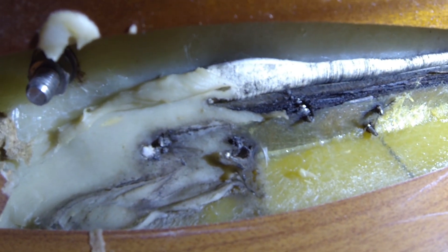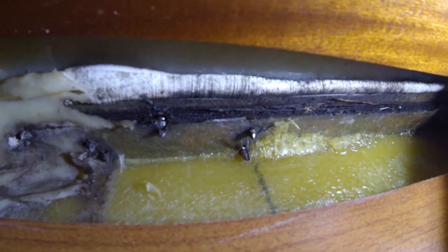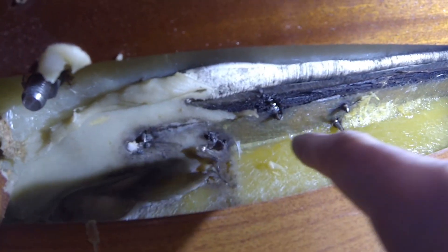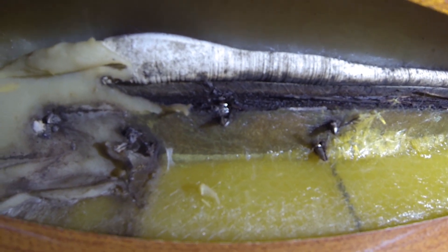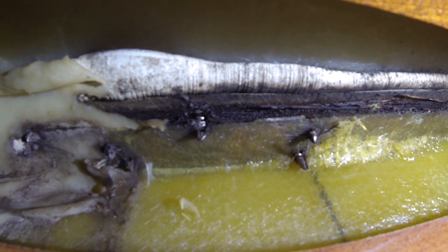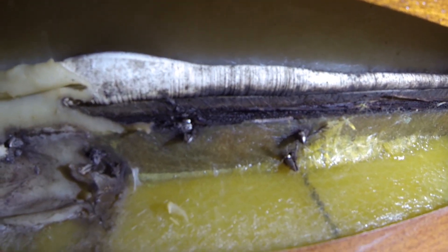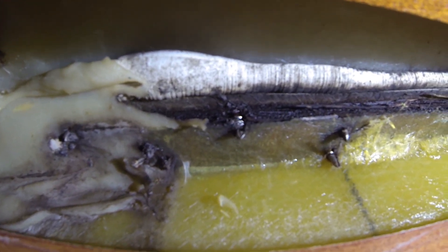As you can see, the bollard on the port side is also leaking a lot — it is very wet with water here. The middle screw of the bollard is not very well supported; it is just totally in the side of the wood. I think I will also build support for the washer so I can press the whole thing together a lot better, and I am very excited to fix this side.